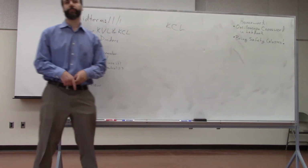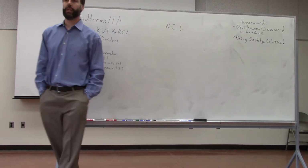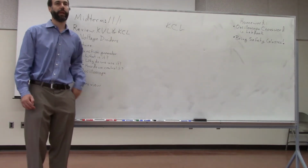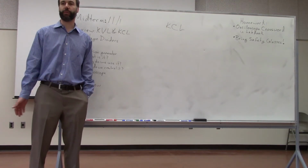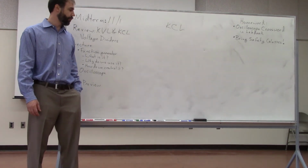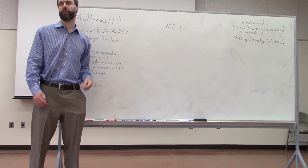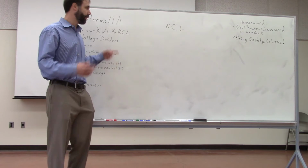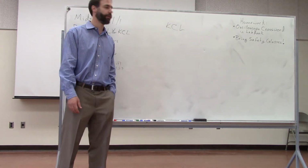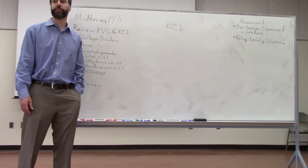The reason that we care about them is because they help us to understand circuits and design circuits. If you are looking at a circuit and you remember these two laws, often they can help you to analyze that circuit and understand how the current is moving around through it, how the voltage is distributed throughout the circuit, right? If you knew that there were 3 resistors in a loop and you knew the voltages on 2 of them, then you could figure out the voltage on the 3rd one, right? If you knew the currents flowing into a junction from 2 wires and there was only 1 left, you could figure out the remaining current that way using Kirchhoff's current law. So these are very useful for helping us to understand and analyze circuits and to design our own.